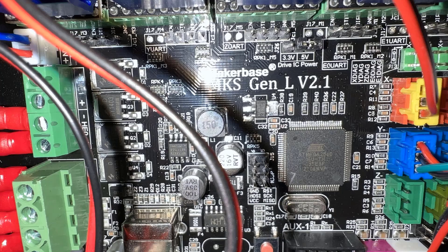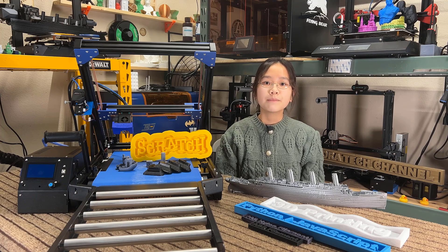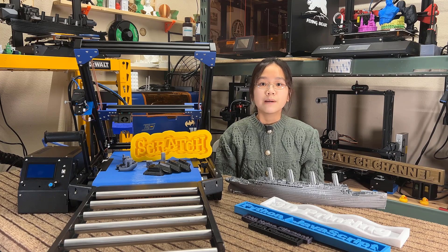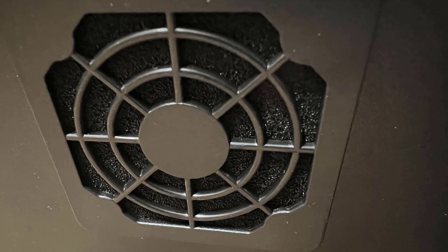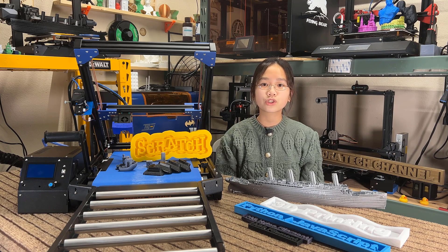Fourth, this printer uses an ATmega 2560 8-bit processor, which is the same as the Prusa MK3S+. It doesn't cause any problems in terms of printing, but as this processor doesn't come with a bootloader, when you compile firmware you can't just copy the bin file to the SD card. Instead, you have to use a USB cable to connect to your printer to update the firmware. Fifth, this printer uses an old-school electronic enclosure like the CR10. This works, but just doesn't look as good as other printers that put the motherboard and power supply inside the machine. Also, there are two fans on the enclosure to circulate air. The manufacturer recommended removing the dust filter on the intake fan to maximize airflow, but I didn't have any issues throughout all of my test prints, as the temperature in my garage is 15 degrees Celsius or below during the winter. However, I may do this if I find it has any overheating problems in the summer.